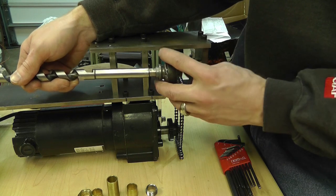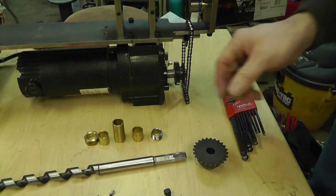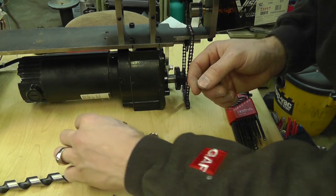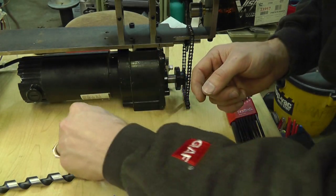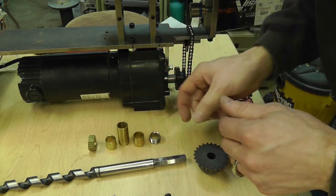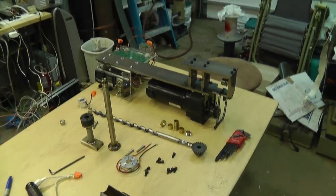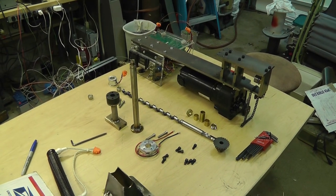That's just a race bearing I welded onto the gear, so I can pull this off and slide it on without ever attaching it to the shaft itself — it free-floats and is kind of self-aligning. It allows the auger bit to freely push against the back of the thrust bearing. Yes, I did make every single one of these shims — not very fun to make — out of some old brass fittings.